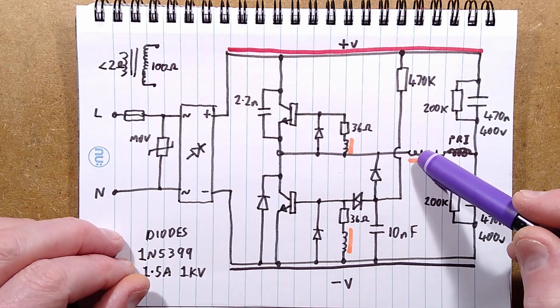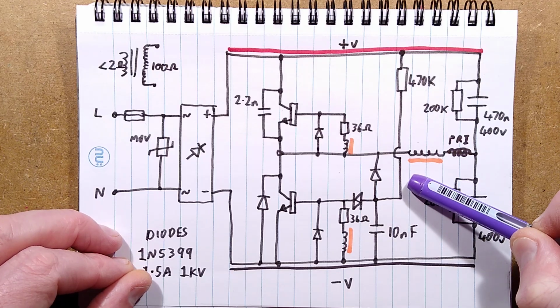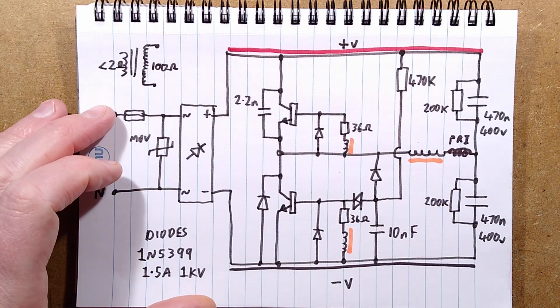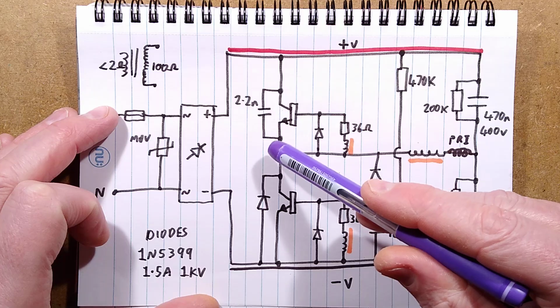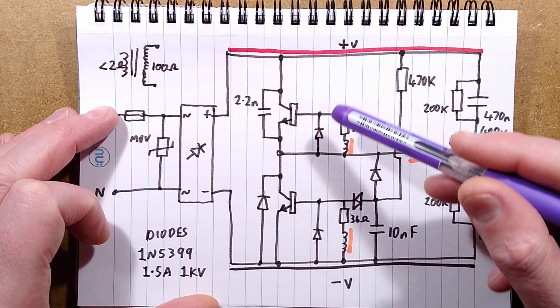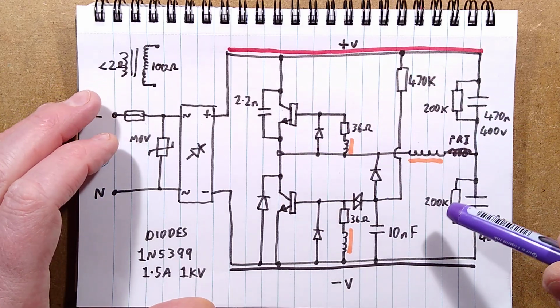The circuitry is extremely reminiscent of the old-fashioned electronic halogen lamp drivers before the era of LED lamps. There are two transistors. These are the ones that are off-board for cooling, and they bridge from positive to negative. One of the most common failure modes is when things get too hot, transistors start turning on, and then they bridge the positive and negative, and it goes bang, basically.